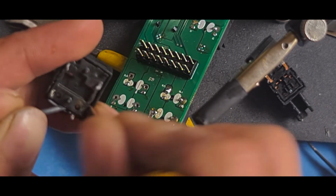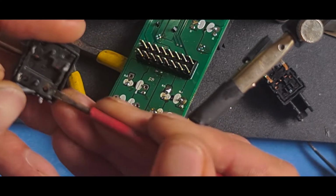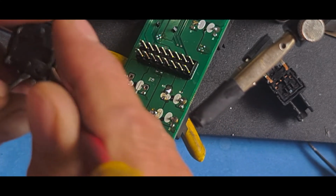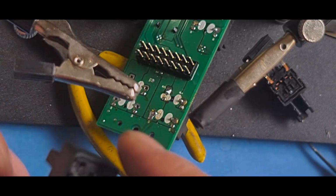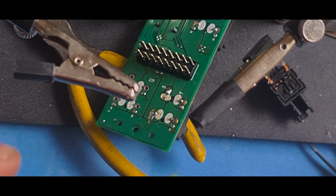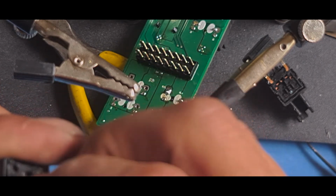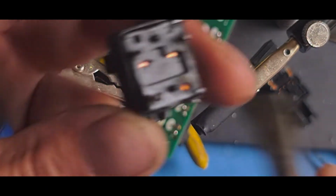Let's see, it's easier. I've got somewhere a mobile phone kit which has very, very thin sheets of steel. Trying to keep it in camera, and you can pop those down the sides here, and one pops out. There you go, it's gone. And each one that you put the steel in will release that clip, so you can separate it all without any major hassle.